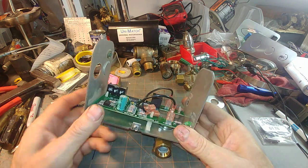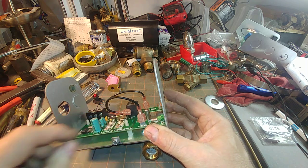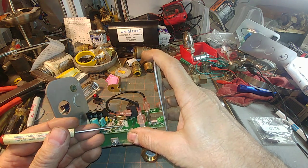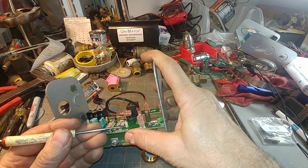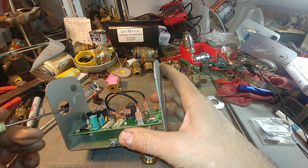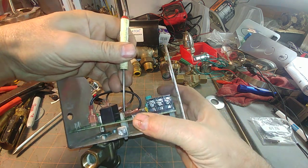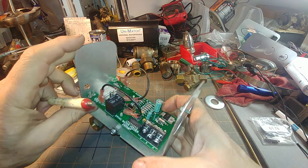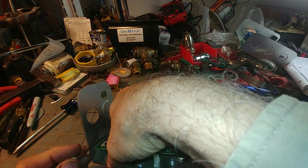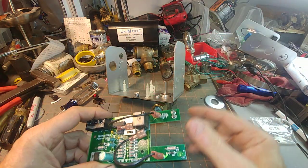Now you've got three plastic hold-down posts, and you want to disengage the little plastic tab one at a time. There's a little triangular tab — push that in and push up gently. I'll swing this around so you can see a little easier. Push that in just a little bit and push up on the electrical, and you've got the one final one. And there's the electrical.